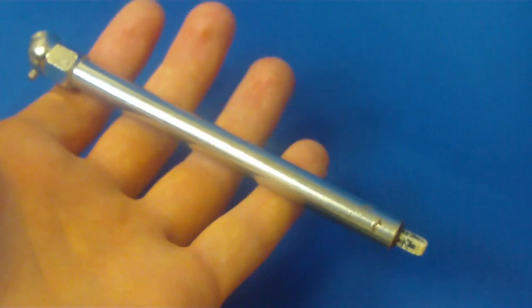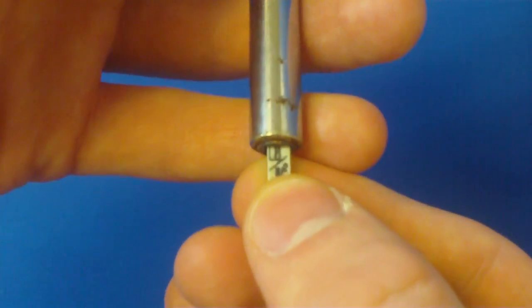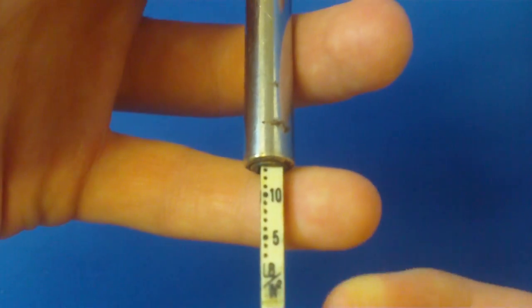The first thing to check is the air pressure in the storage tank. Check the air pressure only on empty tanks. To empty your tank, open the RO faucet and allow it to run until no more water comes out. You can use a bike pump to add air to the tank to speed the draining process along. Check the air pressure using a tire pressure gauge capable of reading down to 10 psi or lower. Once the tank is drained, relieve air from the tank until pressure reads approximately 8 psi.